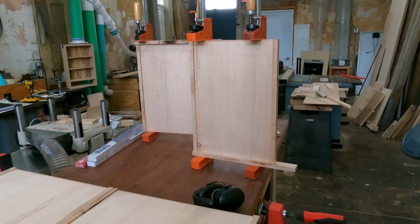All right, so the jig is in place, and you know you did something wrong if, when you drive the screws, you don't hit a stud, because the screws are lined up with where the studs are supposed to be and where you're gonna drill. All right, now just pull this off and do the next shelf up.